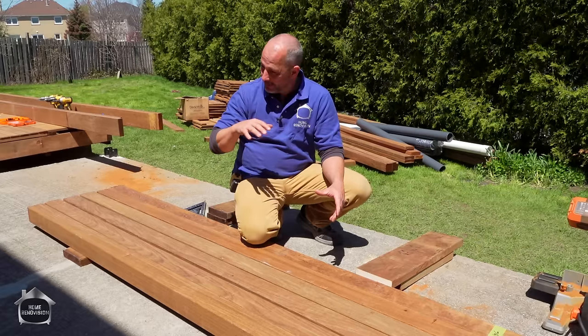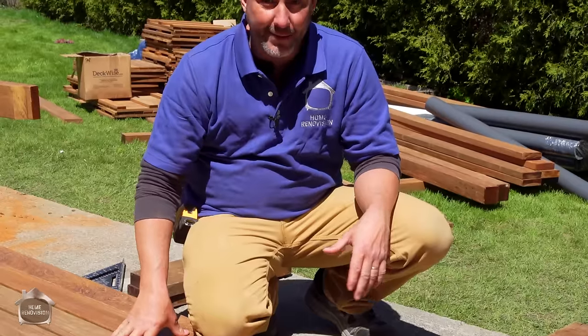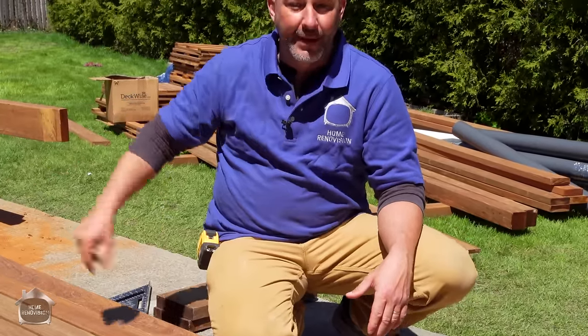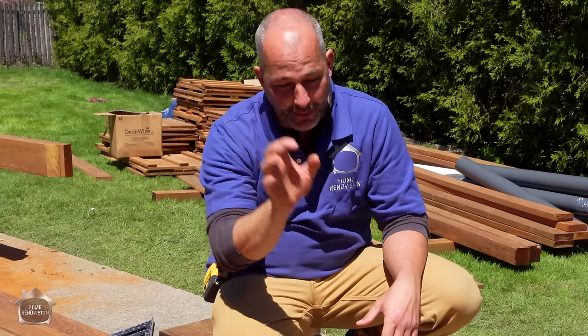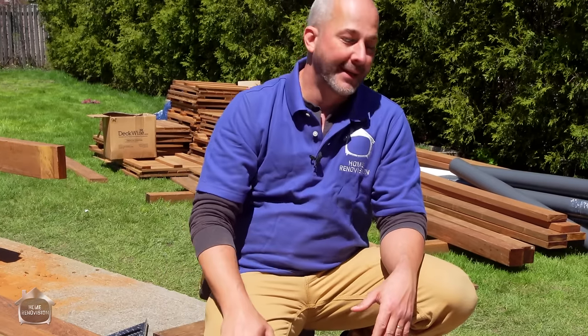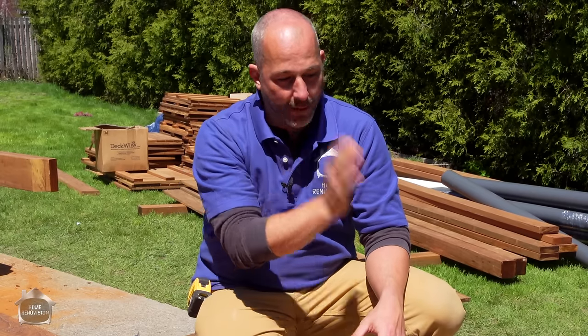We've got our measurements, so now we're gonna translate all that information onto our post. Our baseline is 102 inches, and that's the high post. And now we just add all the dimensions off our leveling system to that number, put it on the tape, on the posts themselves. Again, because it's hardwood, we are going to take the post, we're gonna square off the base in case the mill has it unsquare.